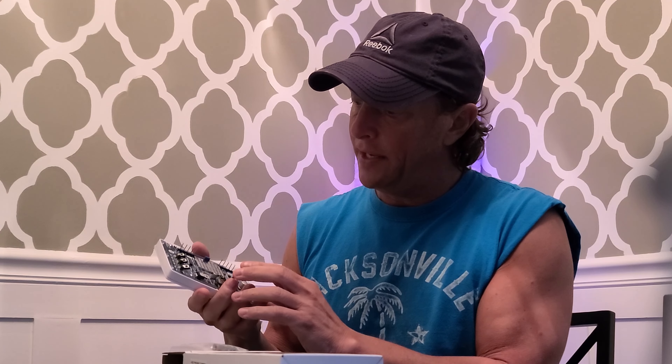This thermostat does have Wi-Fi, though you don't have to use it. If you do use Wi-Fi, you're able to use the Venstar Cloud skill to set the temperature of the house. I've installed several of these and it's pretty straightforward, depending on which AC system you have. If you're not sure, I'd recommend getting an AC company to install it, since you need to know how many stages of heat and cool your system has and what type of unit it is.